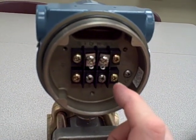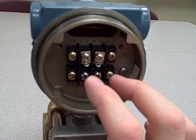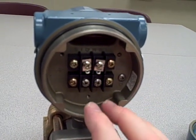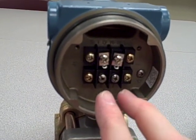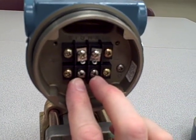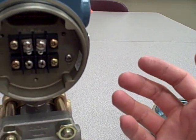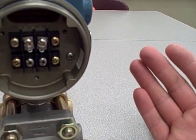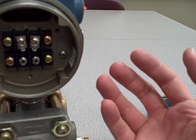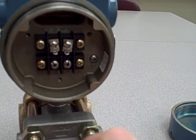That's a very clever way of intercepting a 4 to 20 milliamp DC signal without ever breaking the circuit open — because if you break the circuit open, whatever instruments are connected to this transmitter would lose that signal, the transmitter would power down, and those instruments would see a dead signal. This way, I can tap in with an ammeter for test purposes, diagnostics, or on a semi-permanent basis with a remotely mounted milliamp meter serving as a local indication to operators connected in parallel. And if that local indication ever fails in the open state, the diode takes over and maintains continuity of the circuit.